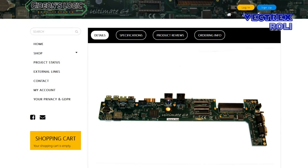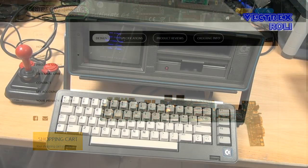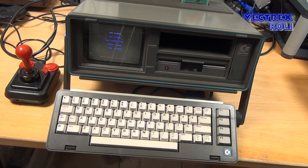computers look and smell. Anyway, before we continue, maybe I show you also the SX64, which is the coolest Commodore 8-bit home computer ever made, in my personal opinion. This was a portable version of the C64 with a built-in color CRT monitor. Very interesting machine, but usually you need to do some repair and renovation work, often the integrated circuits die from heat. I also had to replace one disk controller chip in my computer here when I got it, and I put also a heat sink on top of it.